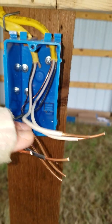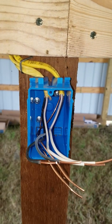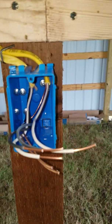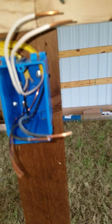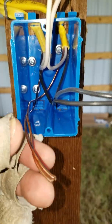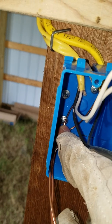First things first, we arrange the wires. Arrange the wires so they're not all crossed over, not all jumbled. Just separate color to color and get all the other wires out of the way. Put the whites at the top — they don't have to be at the top, but you see they're not crossing over or anything. Same with the blacks and the grounds. Push these wires to the far back corner as much as possible.